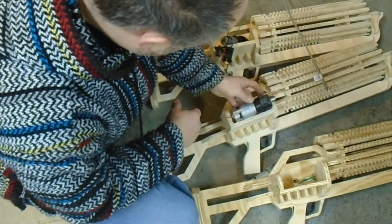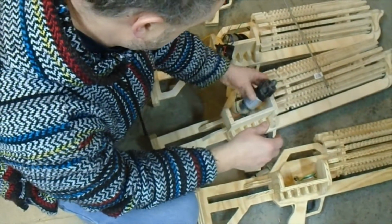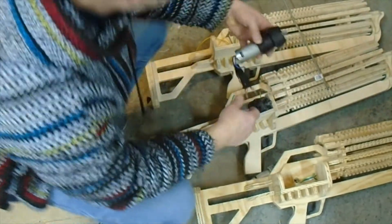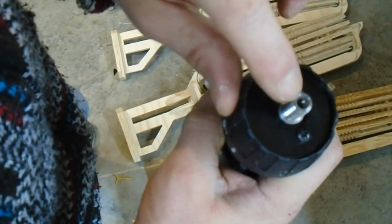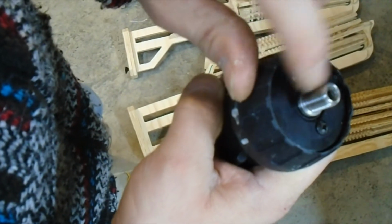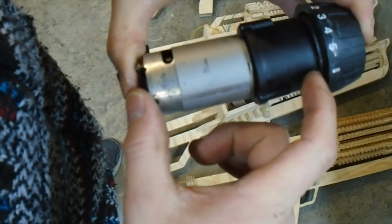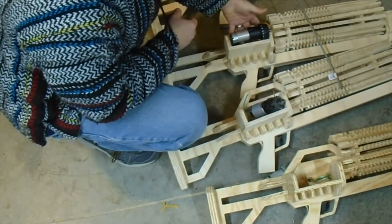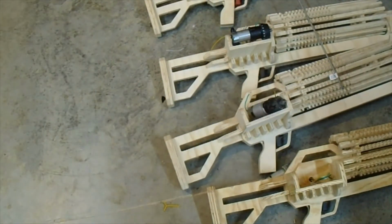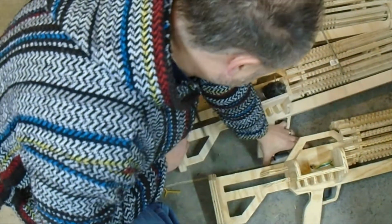I think I can get this in the shot. And it just barely fits, so I'm going to actually have to have the shaft sticking through the wood, which is fine. But let's see, here's one that I haven't taken off the adjustable chuck part yet and kept the original shaft. This shaft I've re-tapped to quarter inch and it's ready to go, but it's a much smaller motor and gearbox, so it will fit with the chuck. So it really depends on what your motor slash gearbox is.